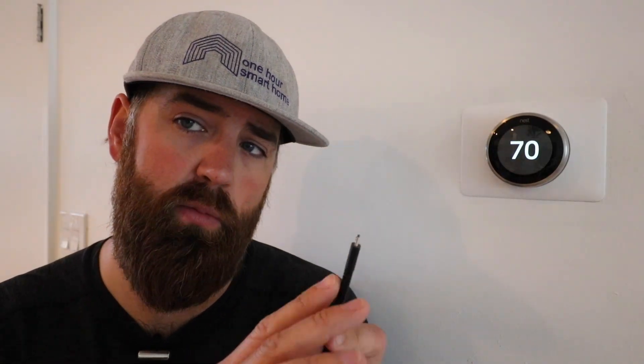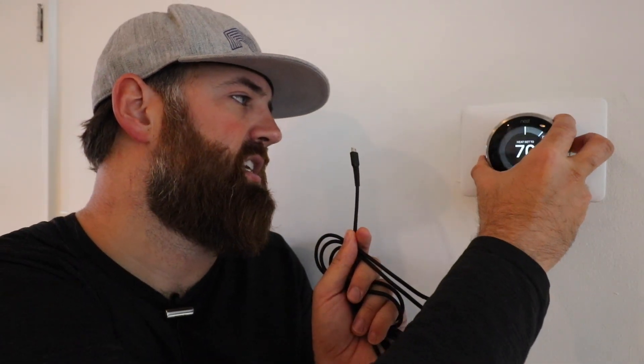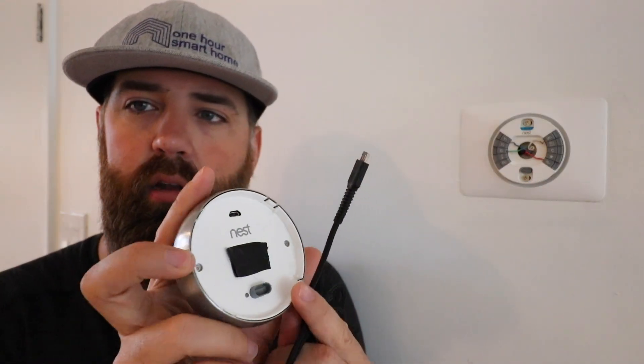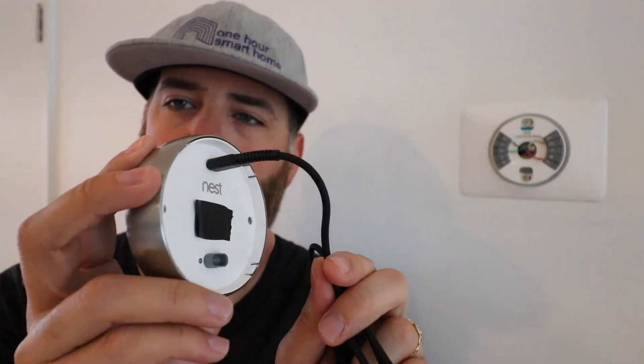Or if this sat in a cold car or a cold house and the thermostat wasn't on for a long time, that battery is going to drain down and you need to have some way to fix it. You just need one of these older style Android charging cables. We'll put a link below. You take the Nest off the wall and on the back there is a charging port. You plug the cord right into the Nest and then plug it into a typical phone charger and give it about an hour, maybe two hours to charge up. Then you can put it back on the wall and that's going to provide a solution for the Nest low battery.